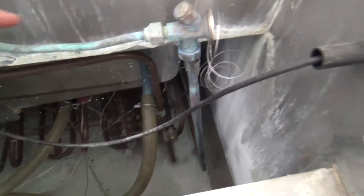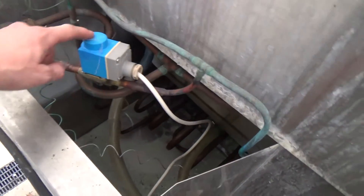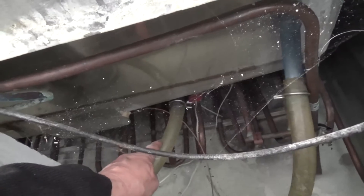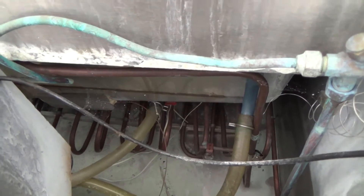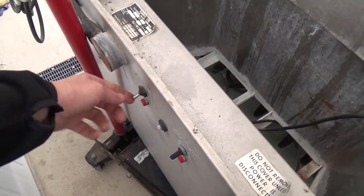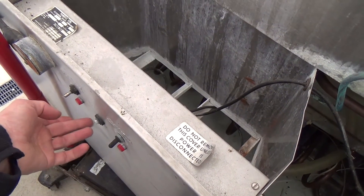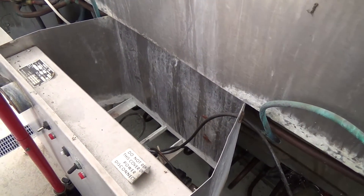We've got two copper coils fed off by two expansion valves, T-ed into a solenoid. And then we've got two submersible water pumps in there to pump chilled water around. They've got a spray around the bottom that fires up against the bottom of the tank where the milk goes, and then there's a ring all around the top of the milk vessel with holes in it to jet water on. That runs chilled water down the outside wall of the tank and cools the milk on the inside. That's your automatic and manual for the milk cooling water and manual from the ice building, and a two-minute stir to ensure the milk's mixed up nicely — so if you want to take a milk sample, it's all mixed up.